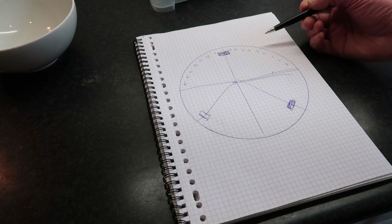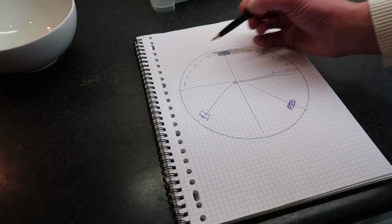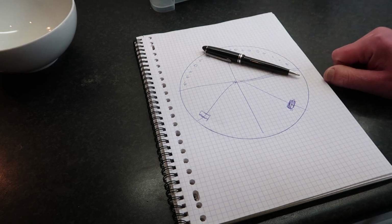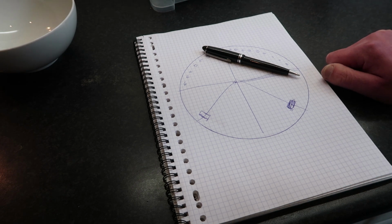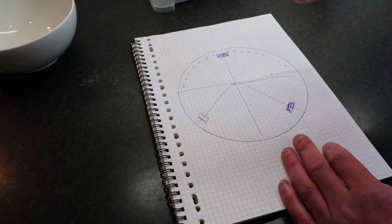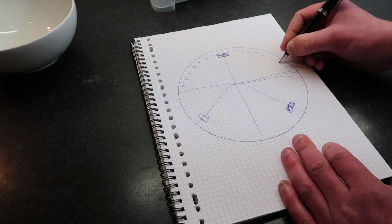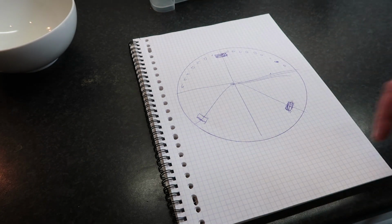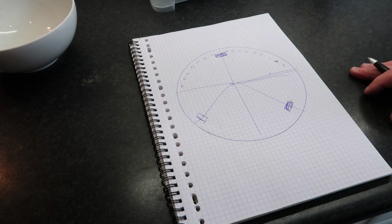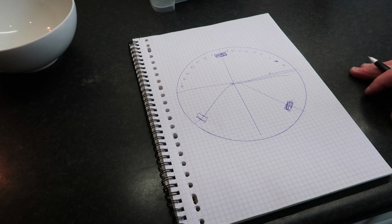And then on the top plate, so that will be this plate, there will be a piece of M5 or something, I don't know, M6, M8, who cares, and just use a spring so you can pull the pin up, move it 5 degrees, drop it down into the hole, and you have turned the table 5 degrees. I think that saves around 50 euros, so yeah, I have to get up every time I do it, but who cares? At least it's consistent. So that's what I'm gonna do.